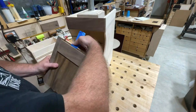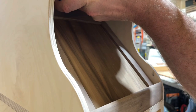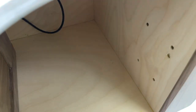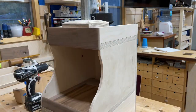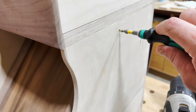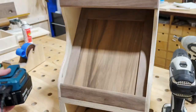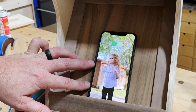To get the shelf at the right angle, I use blue tape as a handle to push it into place and make a mark exactly where I want it, then extend that mark down by half the thickness of the tray. I drill that hole out on one side only, countersink it, bring the shelf back in with the wireless charger, continue the hole through it, and hand-install a flush trim screw. That's how I install the wireless charger — a little unorthodox, but let's test it out. Moment of truth — oh yeah!